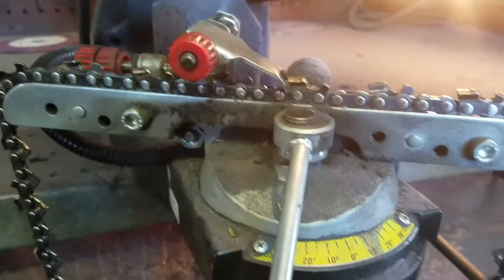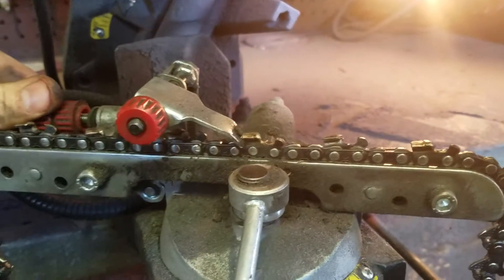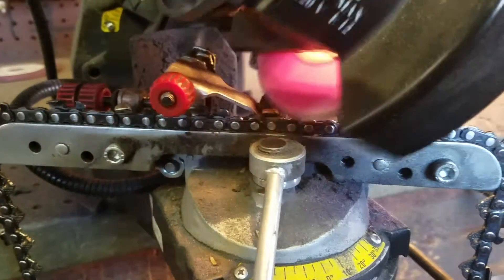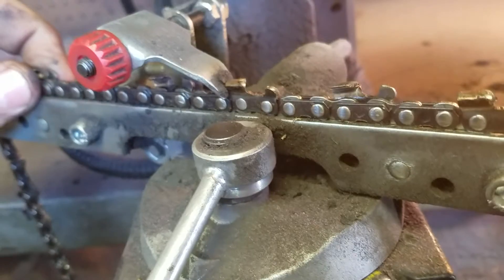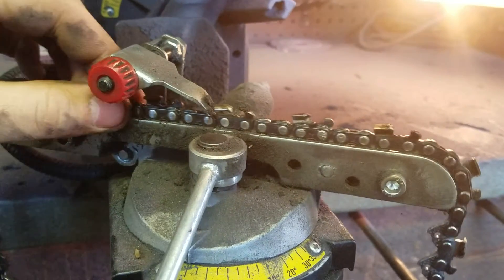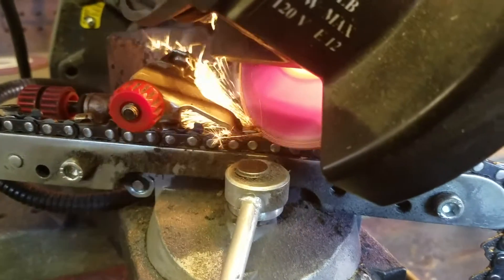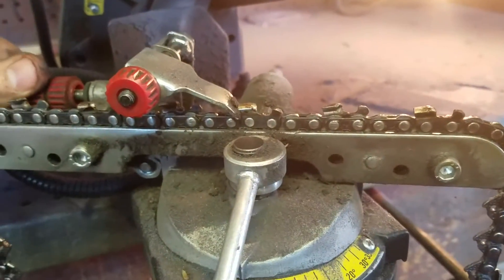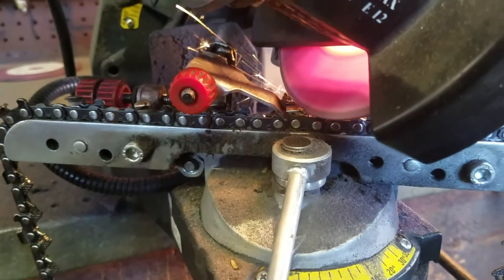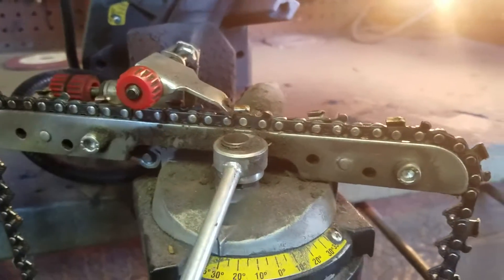All right, so we're ready to go. The goal here is to take enough off. I need to go in a little more. I might end up having to make a couple different passes on this chain because it is so bad. You move it forward, go up a little — I might have to bring this out just a hair, it's a little too tight. I only like to take off what I absolutely need to to get a good tooth. I'm actually going to have to make a couple passes on this because these teeth are so bad.